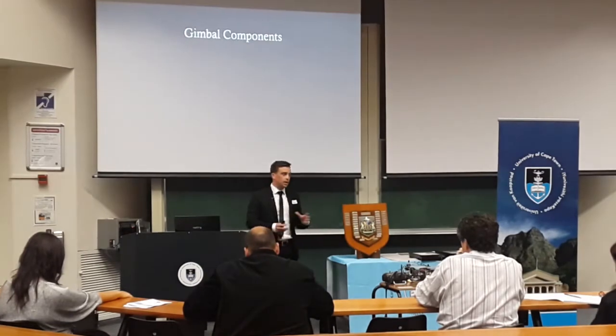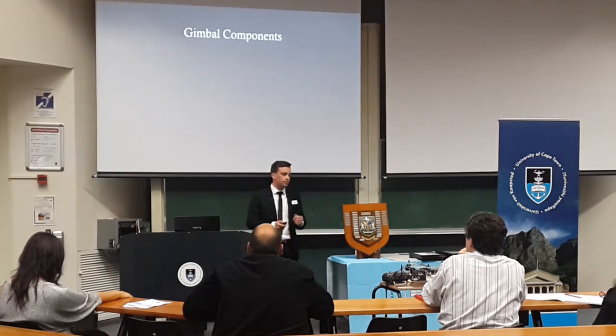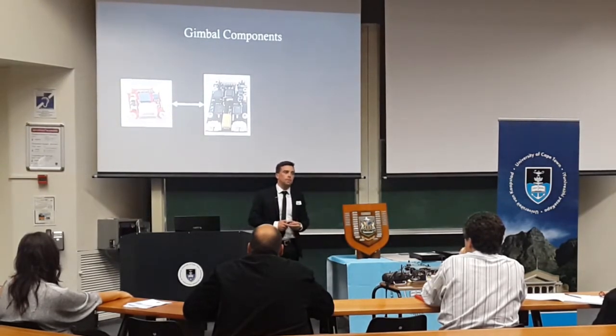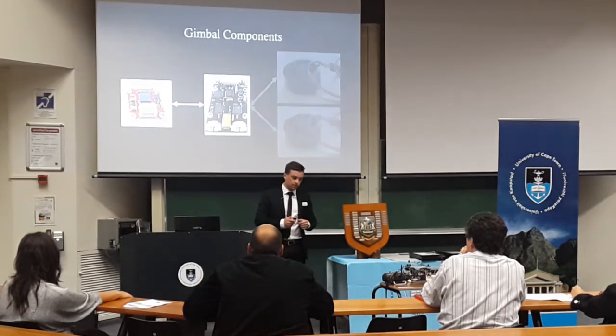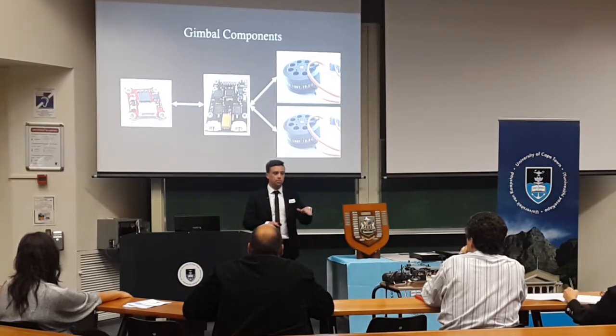In terms of the gimbal, which is really a whole project on its own — similarly to the flight controller for the aircraft, the gimbal has a controller which decides and interprets the conditions: how the camera is rotating and the speed at which it's doing so during flight. There's a small chip called an inertial measurement unit, which is mounted to the camera and records the speed at which the camera is rotating and the degree to which it has rotated. It tells the controller, and in turn the controller tells the two gimbal motors which way to turn in order to keep the camera level. You do get a three-axis version — this is slightly more simple.